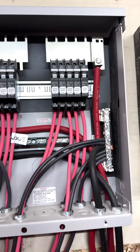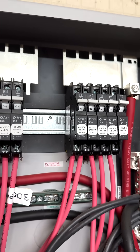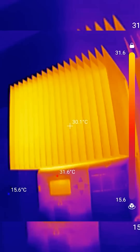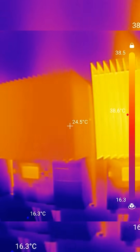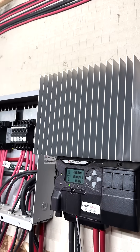It's also important to note that when a surface is reflective, like glass or shiny metal, it looks like there's a hot spot, but that's just a reflection, probably off this light over here. Look at those heat sinks though — even though they are reflective, the one in the middle is not currently on because it's in float mode, so it's still picking up real data.